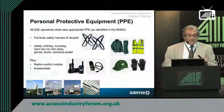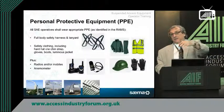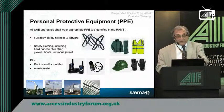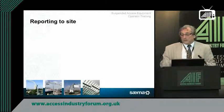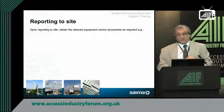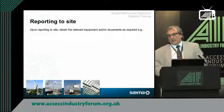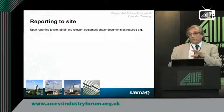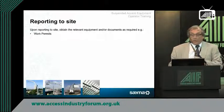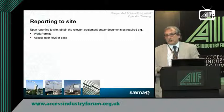An anemometer is very often called for so that you can tell just how windy it is. On any building there's always a quiet side — the north face may not be affected by the wind that day while the south face could be very exposed. Reporting to site should be within site rules: the window cleaner or operative has to report that he's there, sign in, check in, and sign for keys to get to the equipment — not just wander up and jump in the cradle. Work permits are very often a good idea, giving an authorised record of what time he arrived and what he was doing.